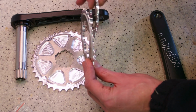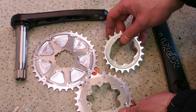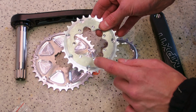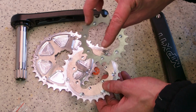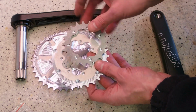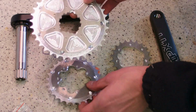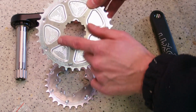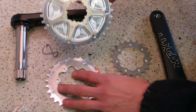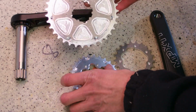Now, since they are made of 5mm 7075, this is really resilient material, so that shouldn't be an issue. But I still need to punch the holes through on all of the chainrings. You can see there are 7 which are marked, but they aren't really through yet. And on these chainrings, I'm going to create a thread in each of these holes, so the screws have some thread to thread into, obviously.